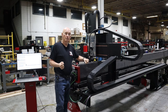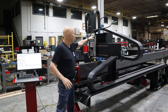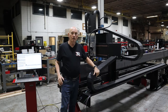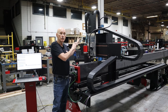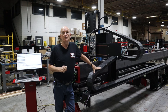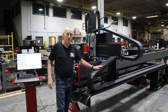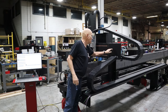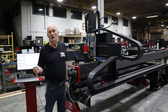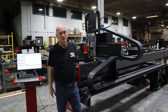So add $30K-$40K to the machine's current list price of $79,900 — roughly $120,000 total — versus $800,000 for a beamline machine. To accomplish all of this we had to substantially increase the size of the control boxes. For instance, we went to a larger cable carrier to handle all the extra wires. We also made it extra large in case someone later wants to run a 300-amp plasma system with a 2-inch body hose. That meant everything we'd already built — all plates, control boxes, trays, back planes, electrical schematics — had to be scrapped.